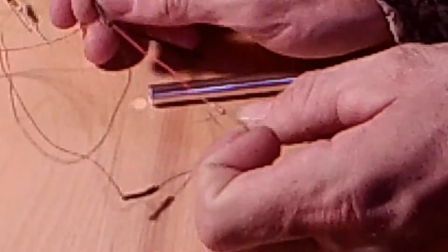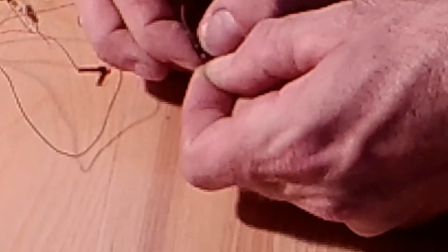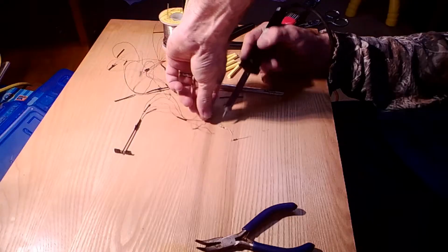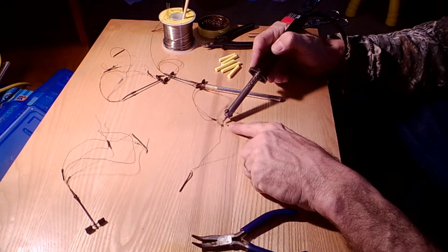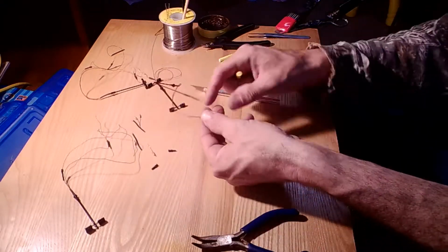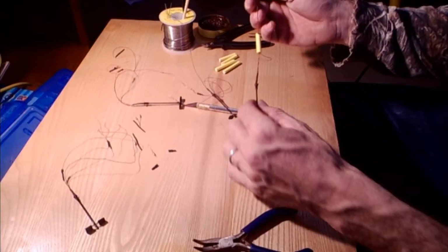So we'll desolder these and take the shrink tube right off. I ended up using one large piece of shrink tube to shrink together both resistors and connected those into the block terminal. Here we're just desoldering the resistors and the ground wire, getting them prepped and ready to insert through the tube. Makes it a lot easier to put the wires down the tube than having the resistors on and drilling a bigger hole, and risk breaking the tube. See there, a tube on wire.